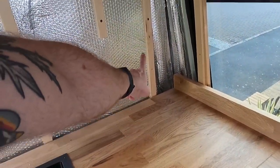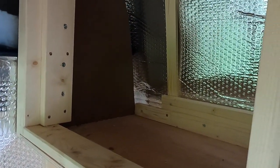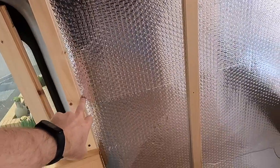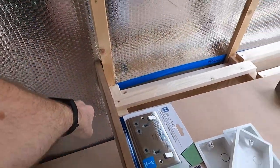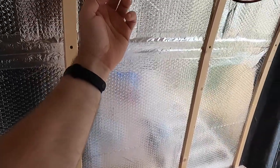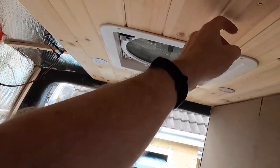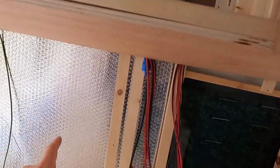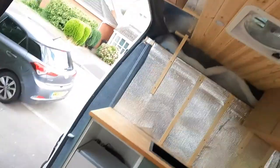With that in mind I've had to be quite strategic about the cable routing. Starting from the furthest plug socket in the corner of the kitchen, the cable will come up the back of the cupboard, along the back of the second cupboard, and into the second plug socket. It'll come out of that socket and down the side, underneath the bench, into a plug socket there, then go over the top following the barrel, into the cupboard, into the RCBO, and then out the bottom of the RCBO into the inverter. I'll feed the full 10 metres now to see if it reaches.